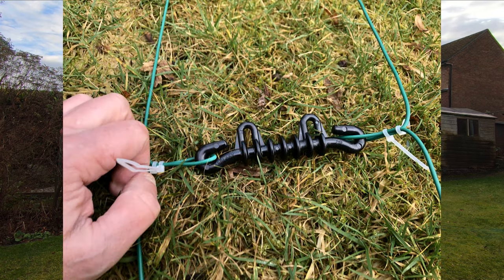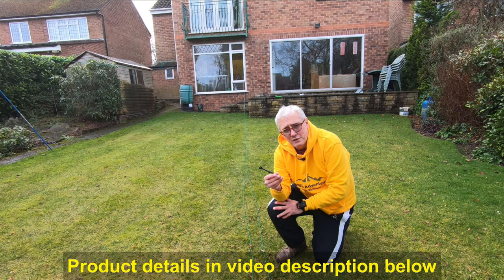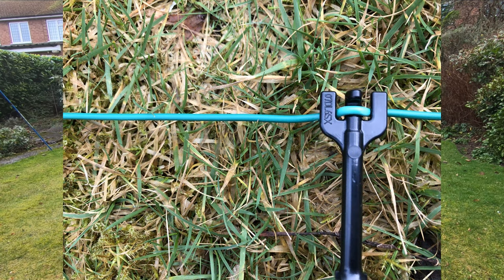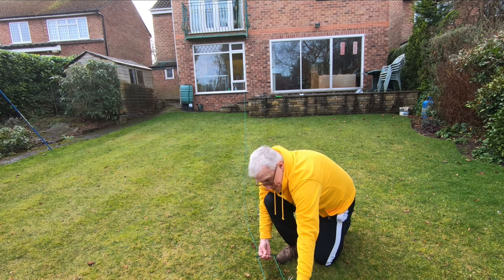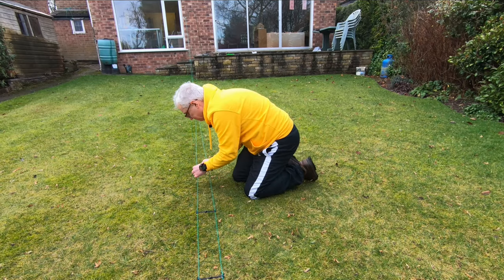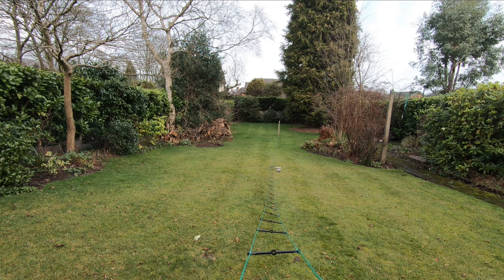So here's our feed point for the antenna, and now we can start to form the feeder which will go back down the wire. To form the open wire feeder, I'm going to use these line spacers which are really nice and simple — they just clip onto the feeder and I'm going to space them fairly evenly so it looks nice and neat. One of the things that makes this antenna so successful is that the open wire line has incredibly low loss, significantly lower than coaxial cable. That means the high SWR we encounter at the feed point isn't a problem with this particular antenna design.